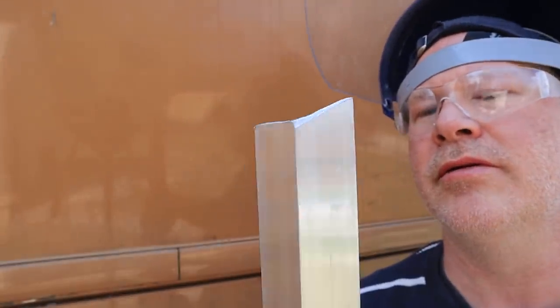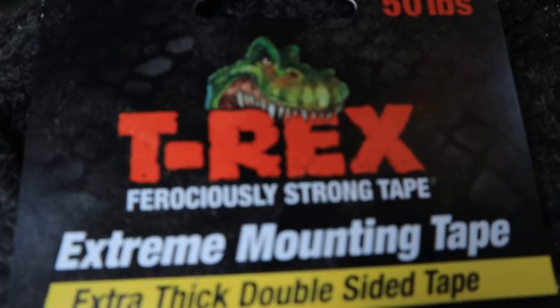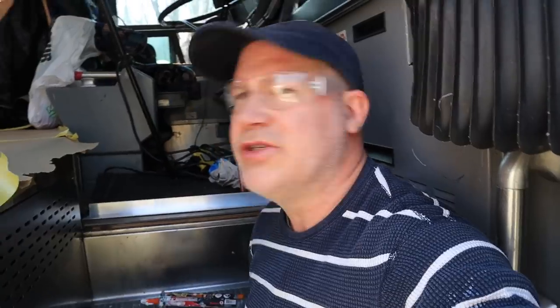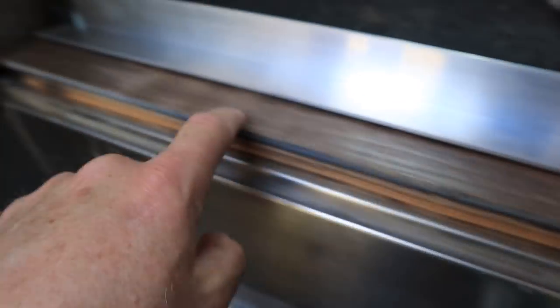Before and after. To get our metal cover over the step, I'm going to use this double-sided tape — it holds up to 50 pounds with a 4-inch piece, so it should be super strong. It sticks to metal, cement, wood, glass, tile, ceramics, plastic, and brick. I've never used it before but it looks like the best option. I'm also going to use a little bit of that heavy-duty Gorilla Glue across the top just where the aluminum meets the vinyl, since vinyl is a very odd surface for adhesive and I found this stuff works wonderfully for it.